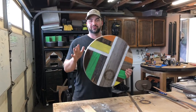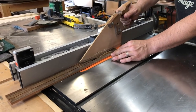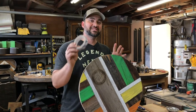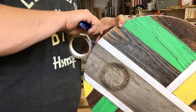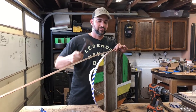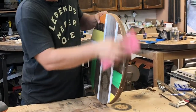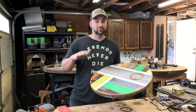To trim out the Lazy Susans I go about it a little differently, starting by making my own rustic edge banding on the table saw. I take leftover pieces of rustic wood and rip it down so it's the same width as the thickness of the Lazy Susans, and I also rip along the edges to get a piece thin and flexible enough to bend without breaking. To attach the edge banding, I'm going to use Fast Cap Speed Tape applied around the edge of the Lazy Susan — this stuff comes in a few different widths. I peel off the backing, attach the edge banding, and I've pre-drilled holes in the strip so I can nail into it without cracking the already brittle wood. Now that the banding is attached, I break the sharp edges with a sanding block. Then I'll come back to all these colors and rough them up a bit with the sander so they have more of a rustic look, since right now they're still too bold and colorful and need to get toned down a little.